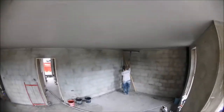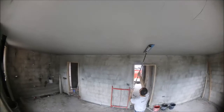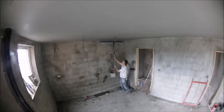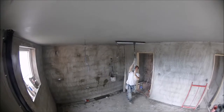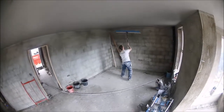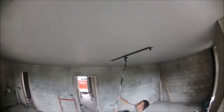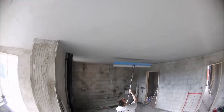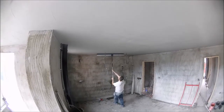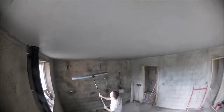This is earlier on — the first head here, actually using the speed skim to give it all a flattening and help straighten all the edges. The ceiling's all been bonded and skimmed, so it was also straightened when we had it bonded. I'm using the largest speed skim I have just to try and find if there are any holes or bumps left from the bottom coat. It did all flatten in quite well — you can see the area you cover quickly with these speed skims. It'll count as a first trowel, but I always hit it at a first trowel anyway. This just speeds you up, takes more lines out quicker, and keeps it a bit flatter. It's a bit more awkward around those wires as you can see with the larger rule.